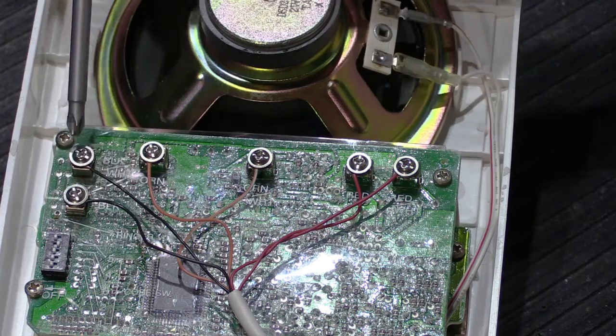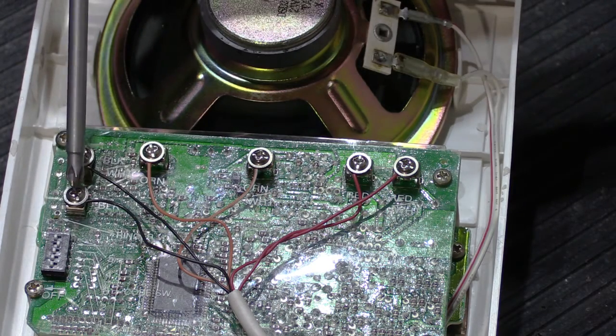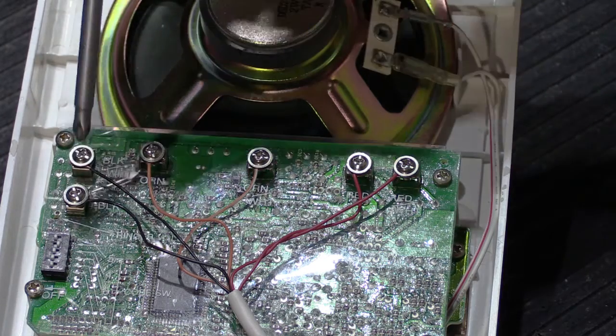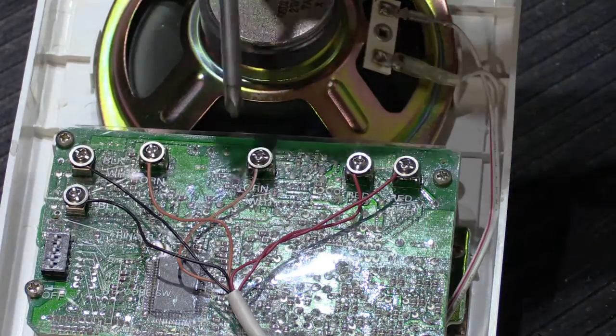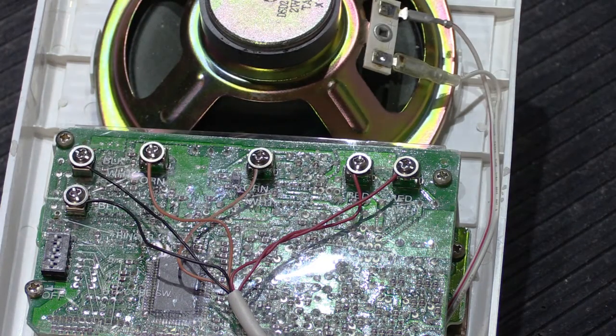The screws are moderately tight — you don't have to wrench on them. Sometimes if the screws are stripped out you'll have to replace them because they do need to be tight. If the wires are loose under the screws, you can have erratic operation on the station, or in the long-term it could damage the station. So that's the proper way to do it.